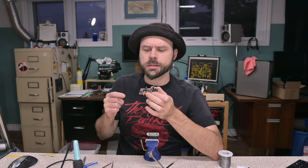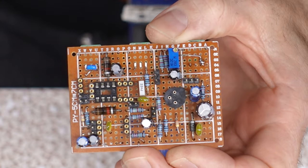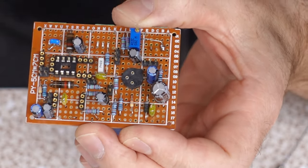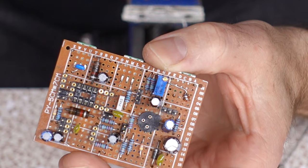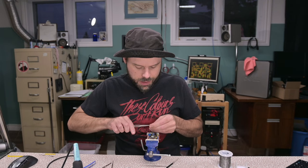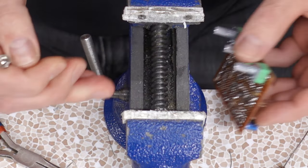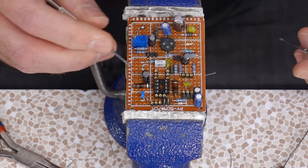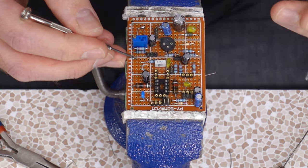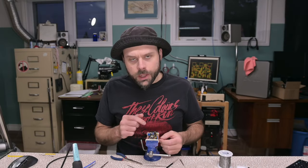I'm looking at this, and I'm looking at that, and it looks like I have everything in place, except for the jumper for the sweeper pot, the tone pot, the filter pot. Until I know for sure what position it is, I can take this and slip it under the bent contacts. Come on, man. Just jam that wire under there, bend those down. Once I can confirm with certainty that that is a correct sweep for the tone, filter, whatever, I'll do something more permanent. But in the meantime, I think we're ready for wire.